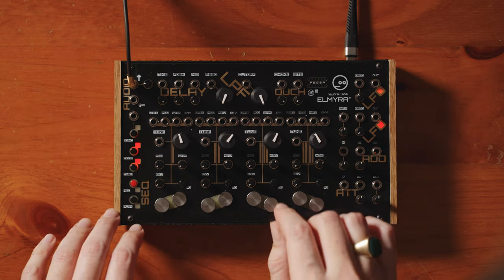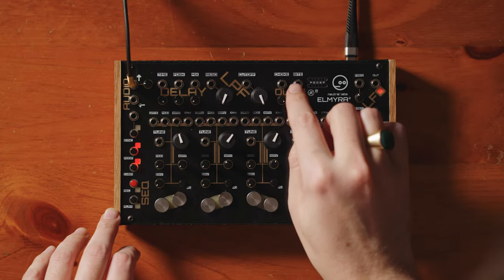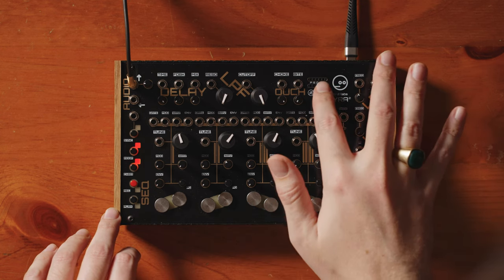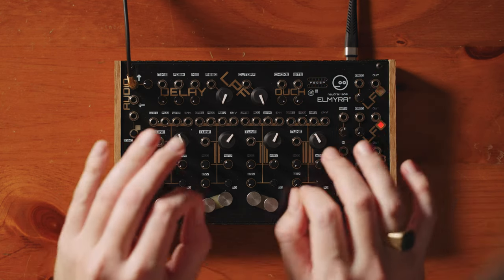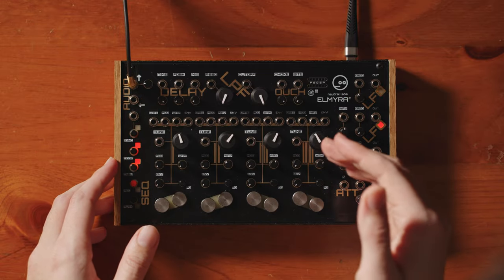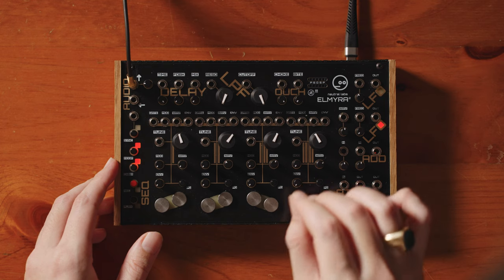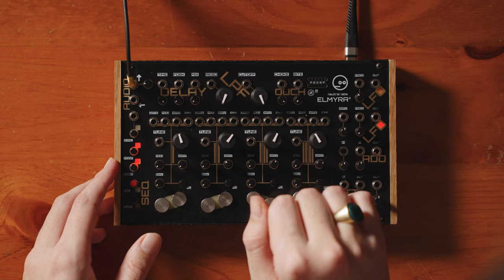The secret Neutral Labs sauce is in the analog, and the rest of the synth is digital, the OUCH circuit, which we'll tackle further down the video and can be further modified with including cards or with electronic components like resistors, diodes, and bipolar capacitors, where bipolar is the important part since unipolar capacitors can get really nasty if exposed to reverse polarity. And I mean, it's fun to make them explode, but maybe don't do it on your precious instrument.